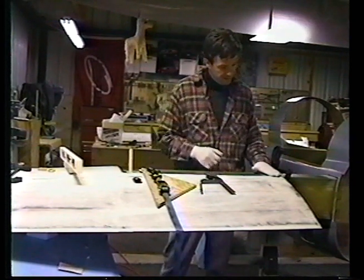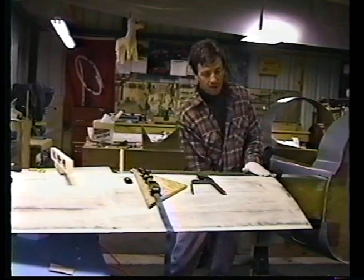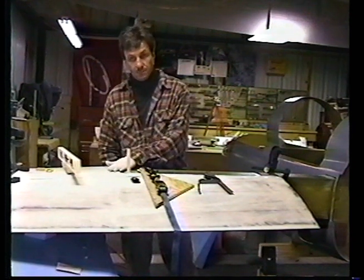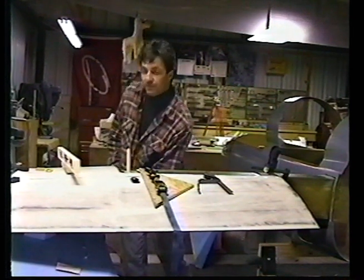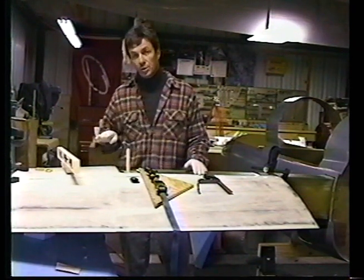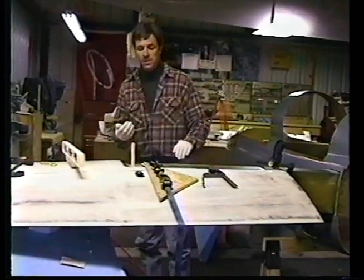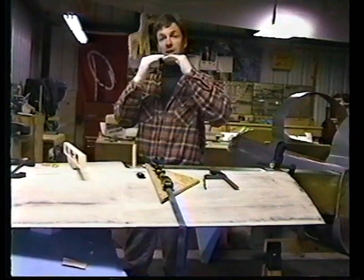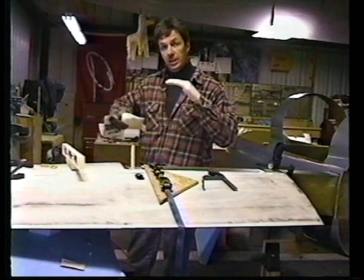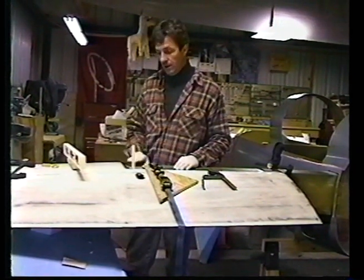On this end, top and bottom, I've got a little less than 1/8 inch above and below the spar. Here, I have about 1/8 inch above the spar. On the bottom side, for most of the airplanes that I've seen, the bottom of the strake ends up flush at the bottom of the wing. The forward corner of the spar pretty consistently sits below the wing contour. But as I mentioned, because of this kick, it's really easy to average in and fill and not be able to be seen, felt, or detected in any way.